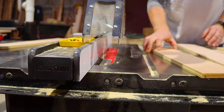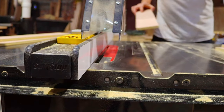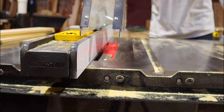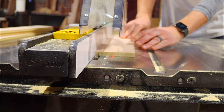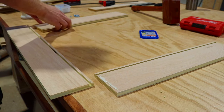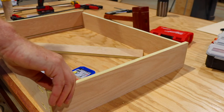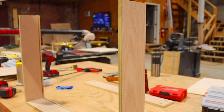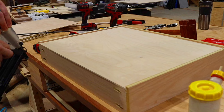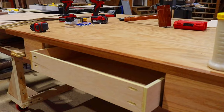Building the drawers was a pretty simple affair. I used half-inch plywood with quarter-inch bottoms. I cut the pieces to length — and I covered this in a YouTube short as well, how you can get perfect measurements to save yourself time. Laziness took over; I didn't want to bring out my dado stack, so I ran each piece through the table saw once, then nudged my blade over about a sixteenth of an inch and ran them through again. Construction was using pocket screws and glue. I measured the bottoms, cut all the individual pieces, slid them in, and glued and pocket-screwed the back piece on. We put some brads in there just to keep everything from sliding until the glue set up — and then we have a drawer.